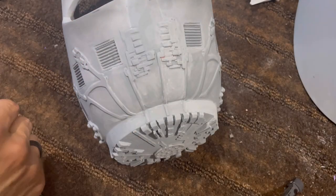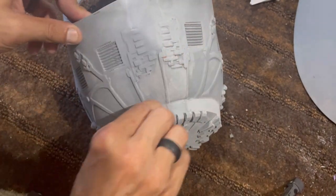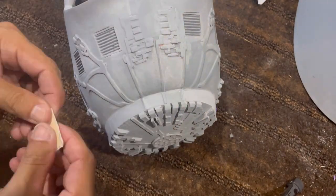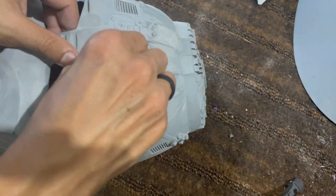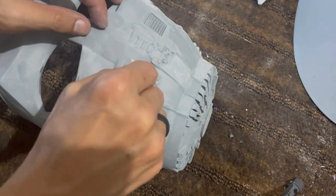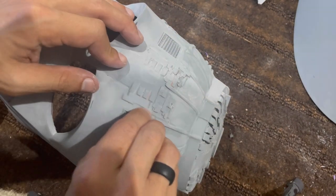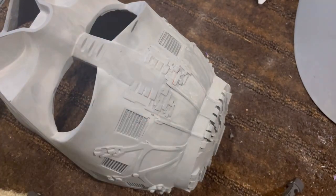And here's just a quick overview and breakdown of the intricate sanding again. Of course, the full in-depth detail can be seen in the video that I have posted. But basically what I did is went through and fine sanded everything in all the nooks and crannies with 320 grit, made sure it was as clean as I could get it, applied 2 to 3 layers of filler primer, sanded it again with 320, applied 2 to 3 coats again, and then final sanded it with 400.